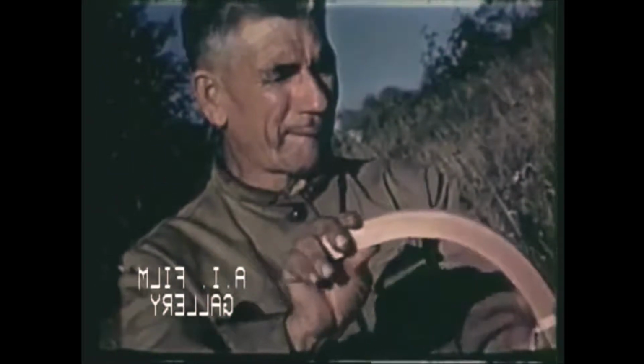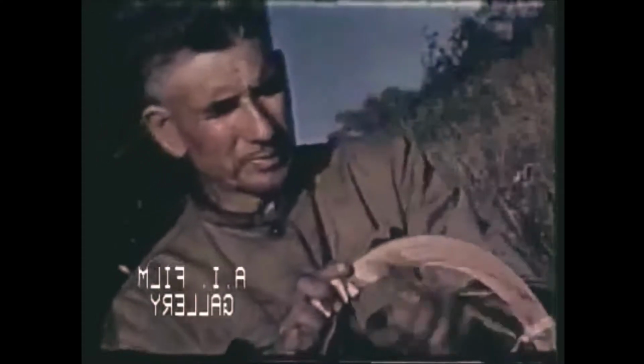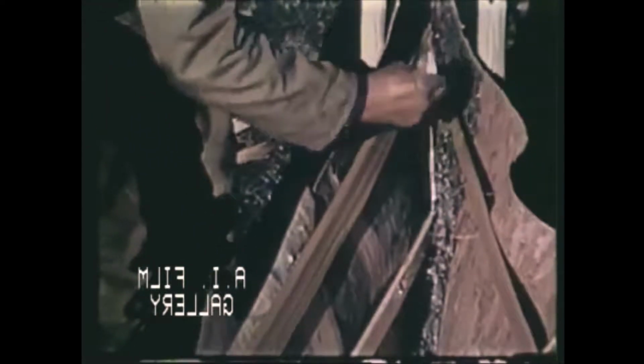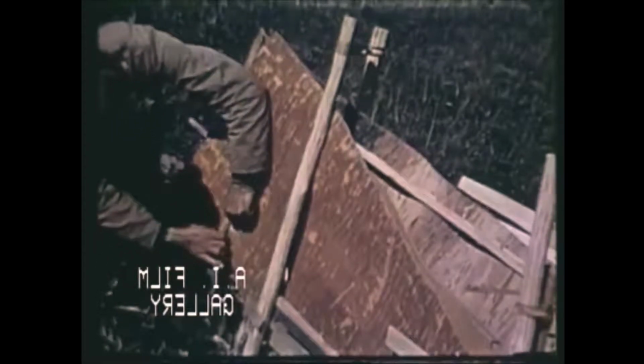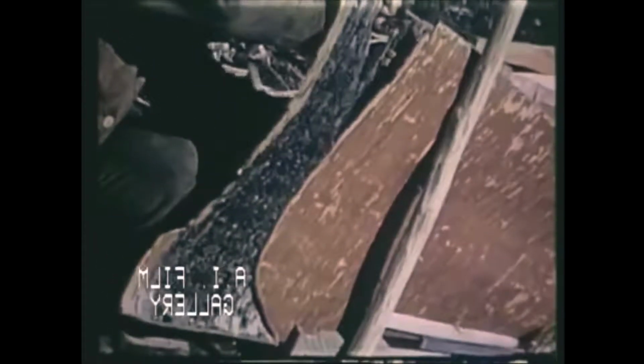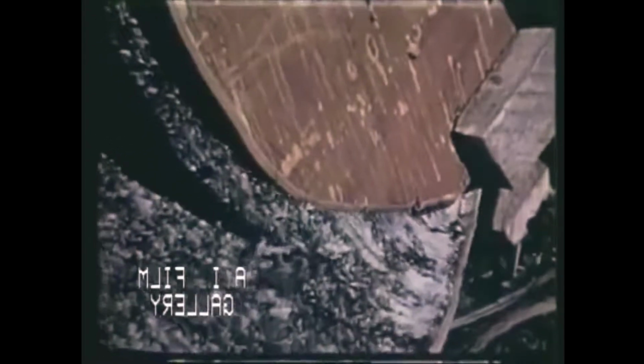A piece of cedar is split into many prongs and bent to form the bow piece. Mat binds it with basswood bark and ties it in such a way that it holds its curve. Then he trims the bark at the prow. He does not leave it high enough to catch the wind and thus make steering difficult. He cuts it to a curve that will skim the water easily.